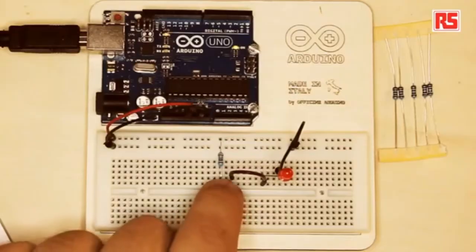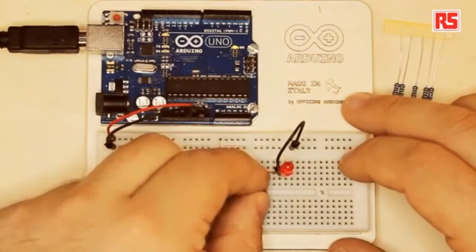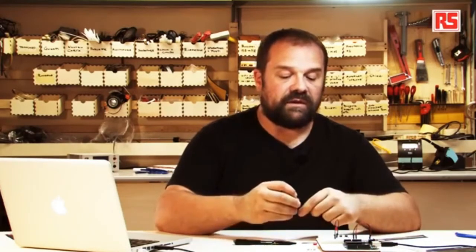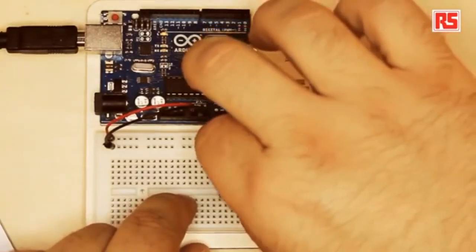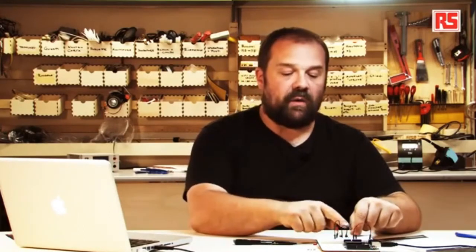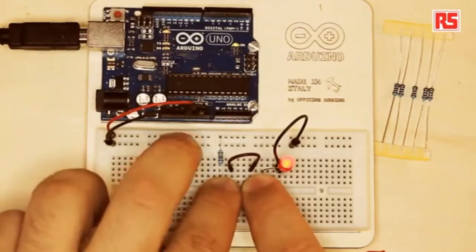We can make this circuit a little more complicated. At the moment we have only one button — what happens if I connect another button? I'll remove this jumper and add another push button, making sure it's connected with the LED. Now when I press these buttons, nothing happens because the circuit is still open. I plug the wires in. If I press one button, still nothing happens. Why? Because these two buttons are connected in series — one after the other. To operate the circuit, I need to press both buttons at the same time. When I press button one and button two, the current flows through the circuit.